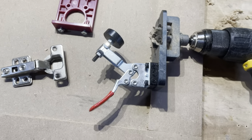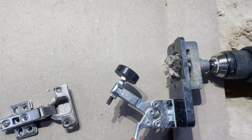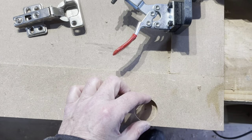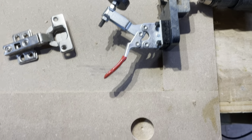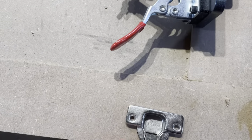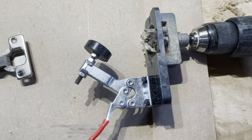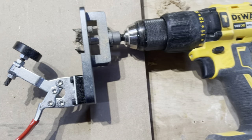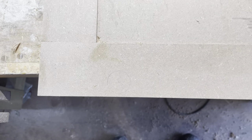I've just bought this jig. I was using it to mark out my holes — I still do the basic marking out — and then freestyle drilling with a stop on another simpler jig. I've bought this new one and just had a go. It's for concealed hinges, so that sits in there nicely. I've worked out how it works: it clamps on, it's much more stable, like a mini drill press for your combi drill — and it works brilliantly for concealed hinges.